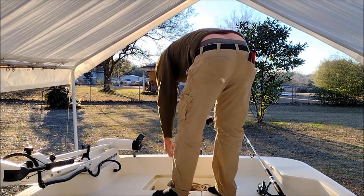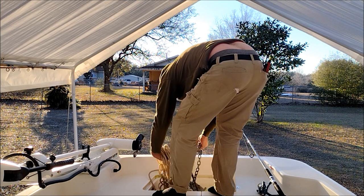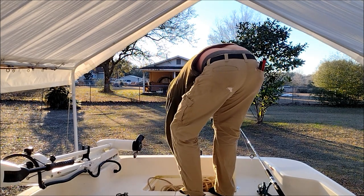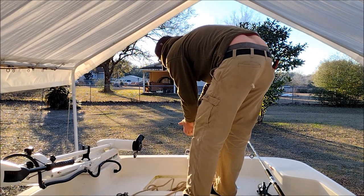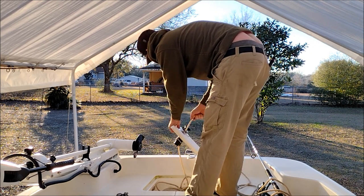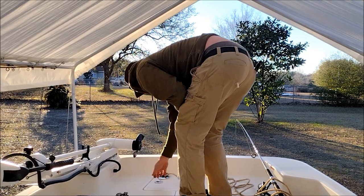As you can see, I can open this up now. Got an anchor chain disconnected from the rope. Pull the anchor completely out of the compartment. Grab the end of the rope, just go ahead and slide it through. Or I can grab the length of rope I think I'm gonna need out. You know, I probably got a decent idea by now how deep it is. So, say I need 20 feet of rope. Close it, lock it. You aren't stubbing your toe on that.